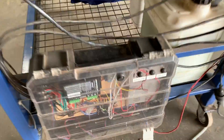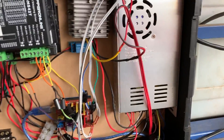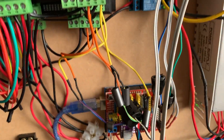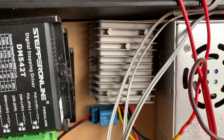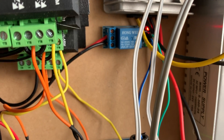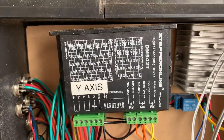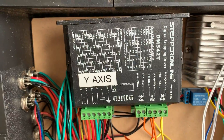We'll start at the electronics box first. It's running off 24 volt. That's the Arduino and the CNC shield in there, and we've got a voltage reducer there that's just for the water cooling. This relay here turns on and off the plasma arc — it literally just bridges two terminals on the machine — and that's the drivers I'm using to run the NEMAs.